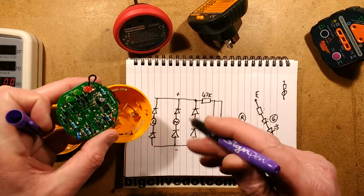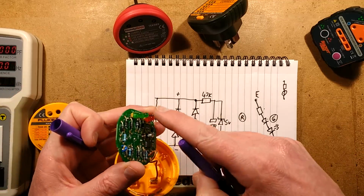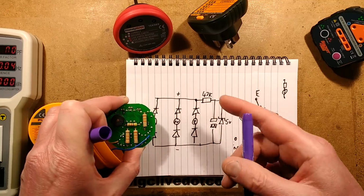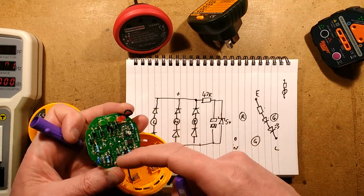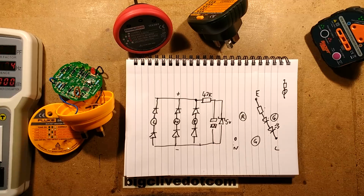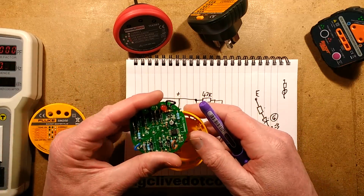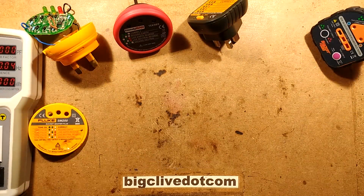I mean, look at this circuit board. 3 of the diodes, these 3 are for the LEDs. So the LEDs, the resistors there, and these 3 big resistors would do the work. Everything else, all the other diodes, the 6 other diodes, all these resistors, the buzzer and this resistor here are just purely for that beeping function. So let's move up a bit the focus and let's do some tests and see what happens.